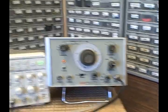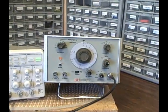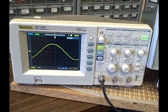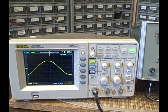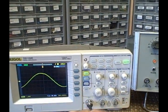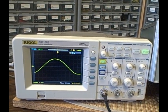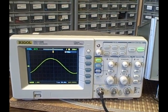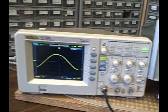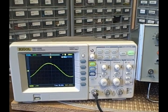Right now we're running in the lowest range at 0.002 Hz — incredibly slow. I have this Rigol DS1102 which has been working the last several minutes to produce the waveform, and we can see by looking at it that it is a sinusoid. It took several minutes to gather the data, and we are on a 50-second time base, so it is very slow.